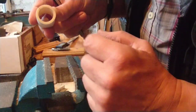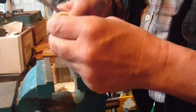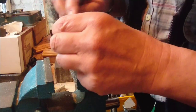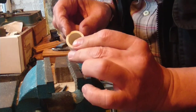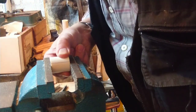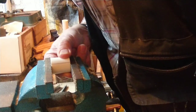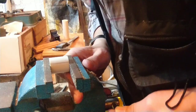The clip will just clip over the flute body, but I've got to get it the right size. Since I haven't got the mark one prototype here to see what width I ended up with on the jaws, I've had to think about exactly how wide to make it. Having decided I've got roughly the right size, I'm going to put it in the vice with my marks just level with the jaws, or just a little bit above where the jaws meet on the inner diameter — those are just guidelines.